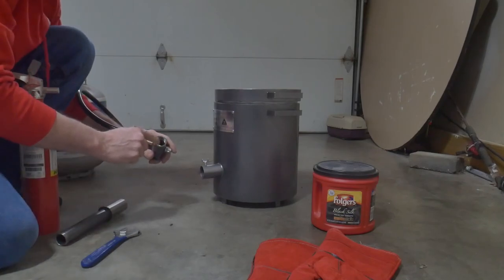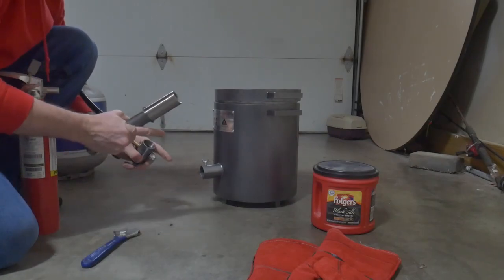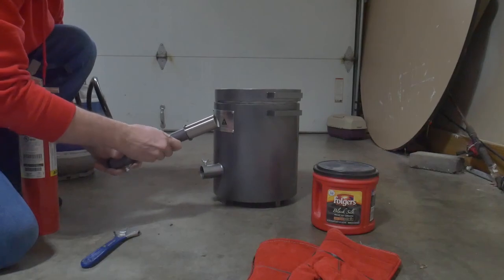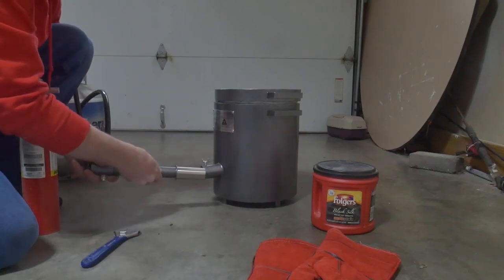I'm making sure that the nozzle is perfectly centered so it shoots down the middle of the burner, because if it shoots off to the side it won't produce a hot enough flame — it'll be turbulent and it just won't give you a standard temperature.